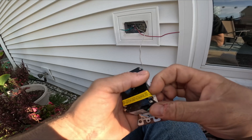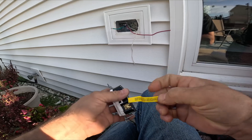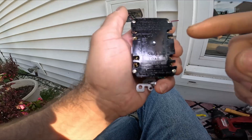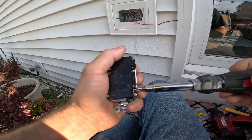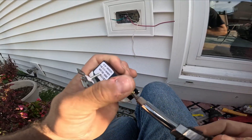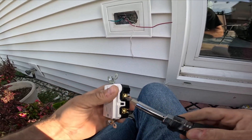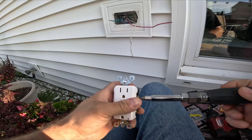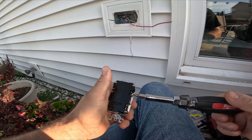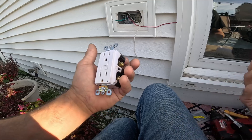We're not gonna use the load side — I always take these off. You can see closely: line and load. That's if you want to hook up cheap receptacles to this and load the downstream receptacles so they act like a GFCI. So you don't have to spend twenty dollars for three — if you want to load three outlets down the line it won't cost you sixty bucks, just twenty plus those sixty-cent outlets.